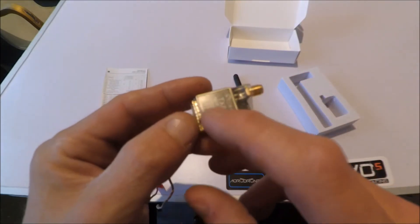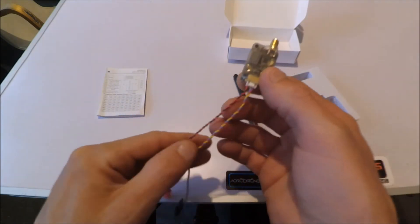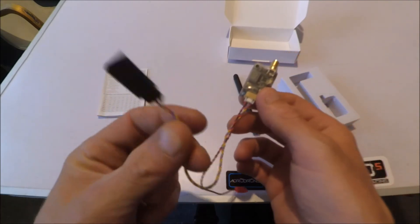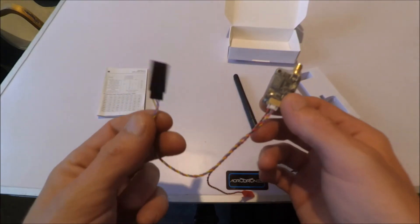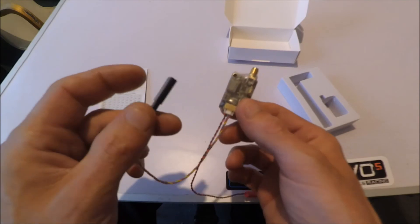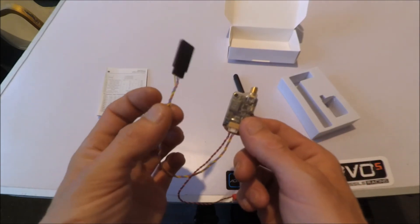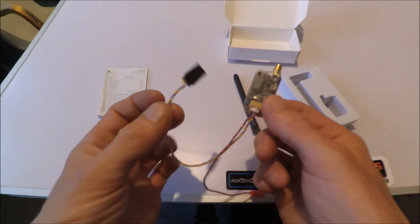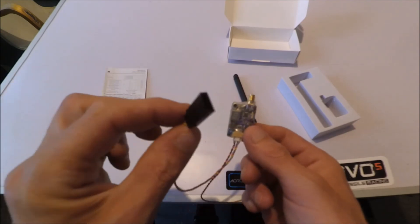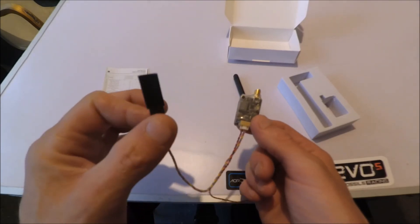It's 7V to 24V, then ground, video, ground, 5V output. All you've got to do is run that to your PDB and run this one to your camera. Personally I wouldn't use this plug for my camera — I am going to test it in a bit to show you guys — but when it's going in my quad, what I would do is cut these wires, strip them, tin them, and splice them to the wire going to the camera, so I wouldn't really like to use that plug just in case, especially on your video — you don't want to take the chance of having a loose connection.